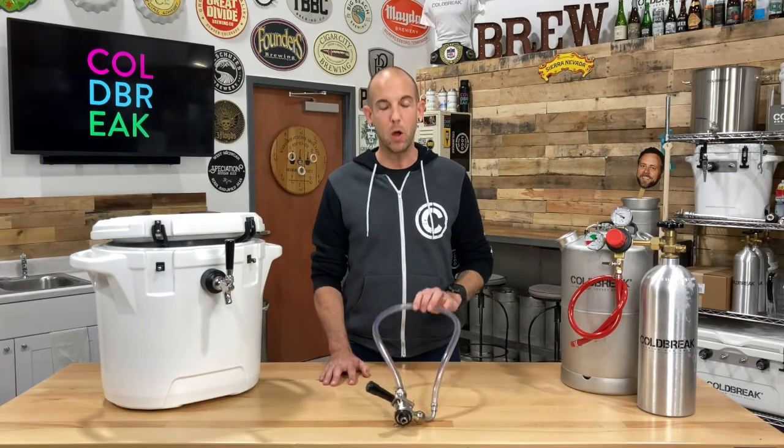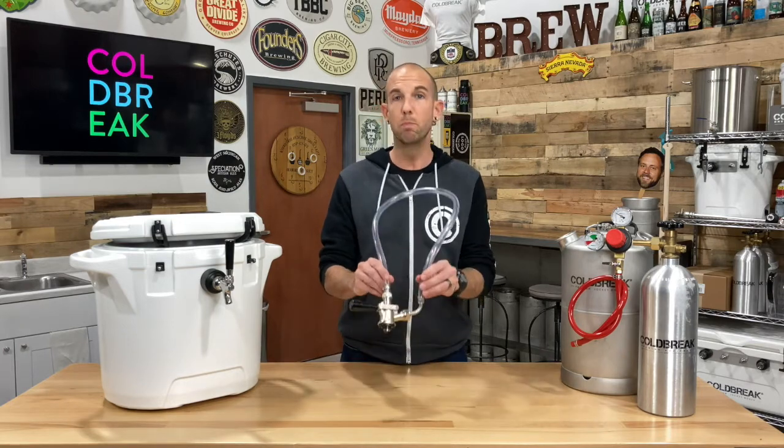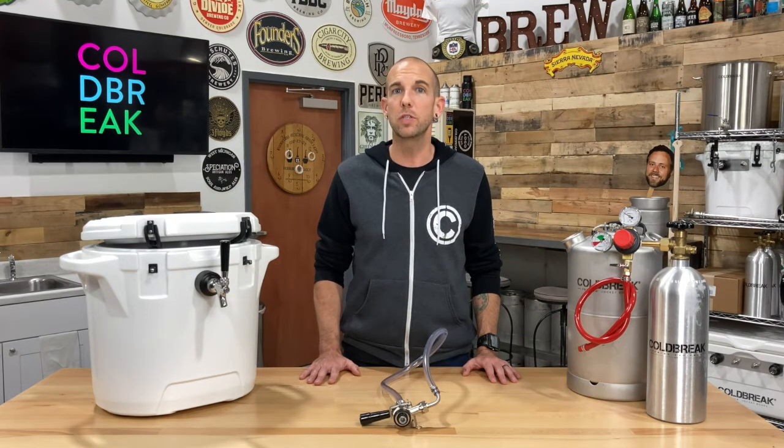Your beverage jumper also needs to be stored dry. Another pro tip is to attach both ends to a coupler to keep them nice and clean. By following the proper cleaning procedures, you're doing the right thing by setting up the next person who uses it for success. Taking care of your Jockey Box will protect your investment and provide a lifetime of reliable use.